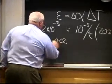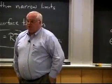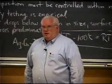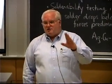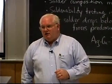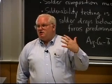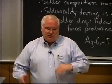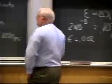Anybody know what a strain of 0.002 means to most mechanical engineers? 0.002 offset is basically the yield strength of the material. That strain is typically close to the yield strength. I've cheated a little bit on you. It's not that I don't cheat in this course.